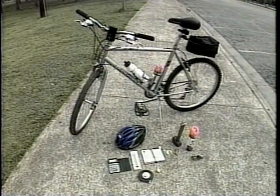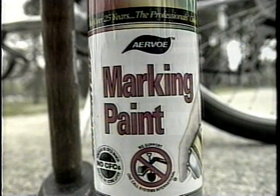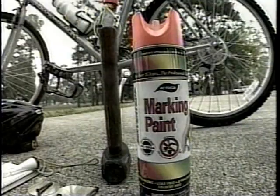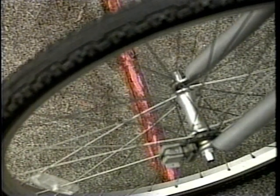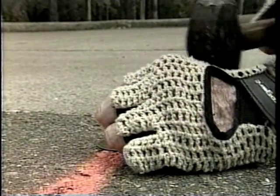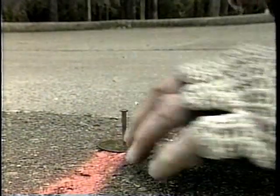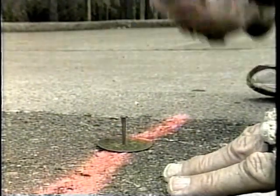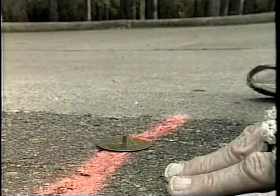Beside the bike and the counter, most of the other items can be obtained at a hardware store. I use a marking paint used by surveyors to mark utility lines. It's available in upside-down cans from surveyors' equipment stores. Marking paint fades relatively fast compared to enamel, so when it's used in residential areas, you won't get quite so many complaints as when you use something more permanent. While you're at the surveyor store or hardware store, pick up some carpenter's chalk, PK nails, and tin caps. If these are not available in your area, washers are handy. You'll use the chalk for temporary markings and the nails and washers for more permanent markings.